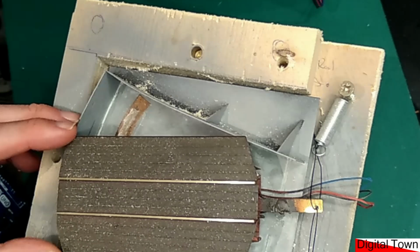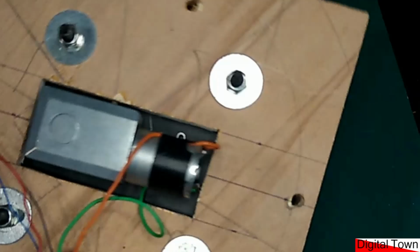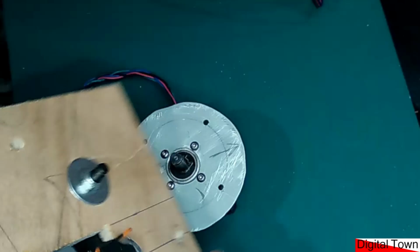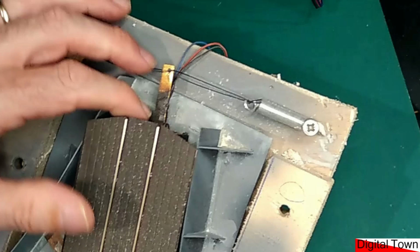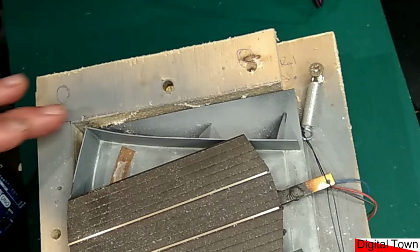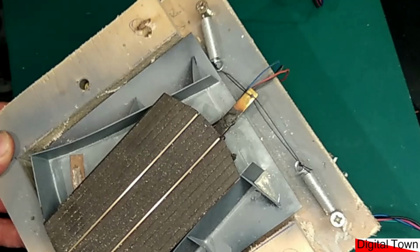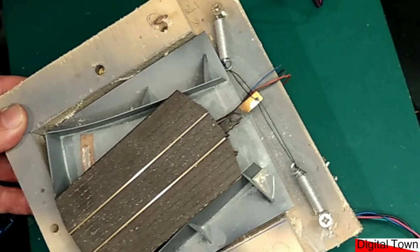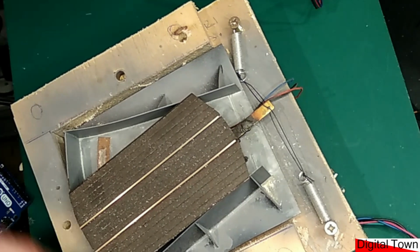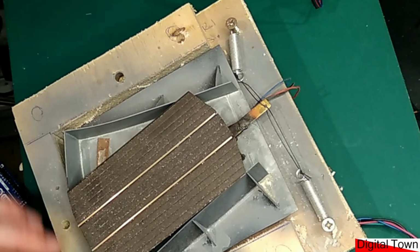This is another example of high torque. This is a piece from a model railway. It's a sector plate that I built, and this relies on a motor with a gearbox that then turns a shaft in here and moves the item backwards and forwards. Now I can tell you, when I first built this, I made a major blunder and messed up the limit switch, and the torque on this was enough to literally tear the entire model apart as it smashed its way and tried to do a full revolution.